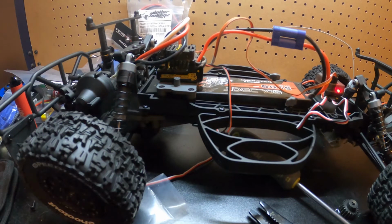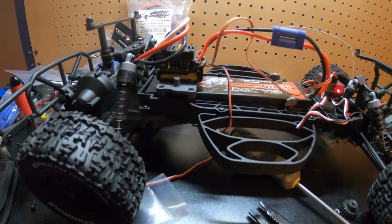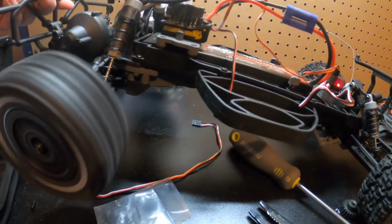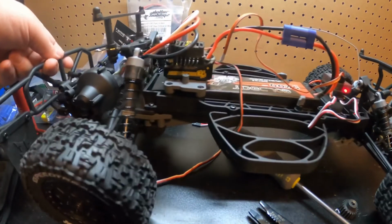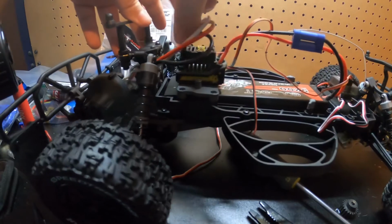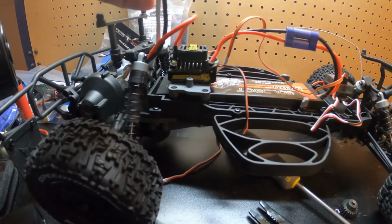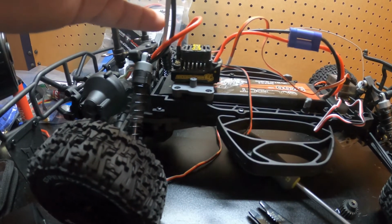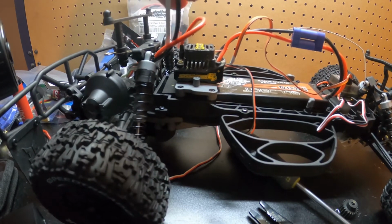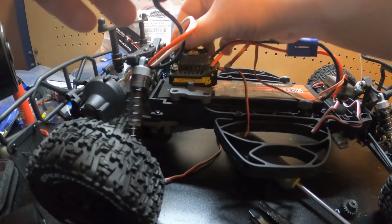So, the other ESC, for some reason, I couldn't get it to calibrate or work. As you've seen, it kind of took off on me. I have a bunch of Sidewinder 4s. So, I got the motor wires backwards, so let me switch that up again quick. I'm going to take some of these and kind of buff them out a little bit, because they're pretty loose, and they shouldn't be that loose. There we go. I don't remember which side we had one on, so...